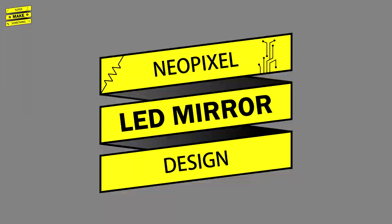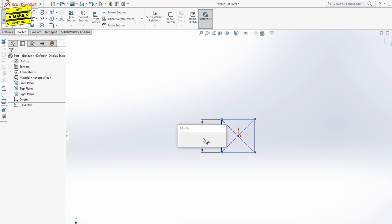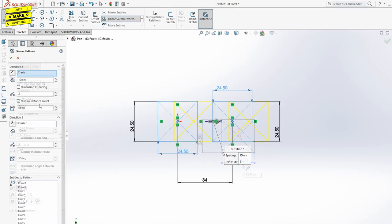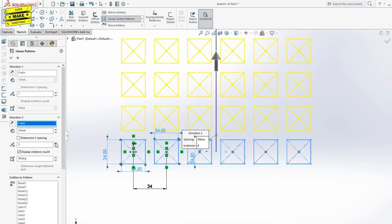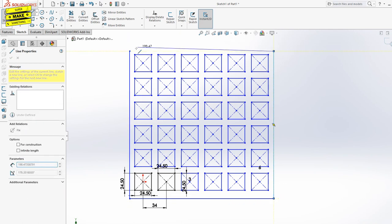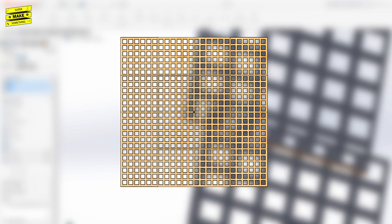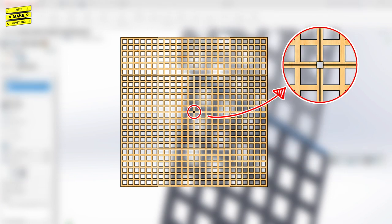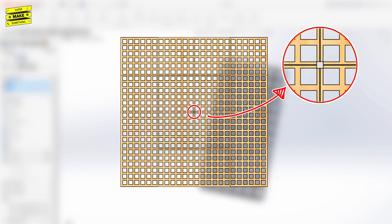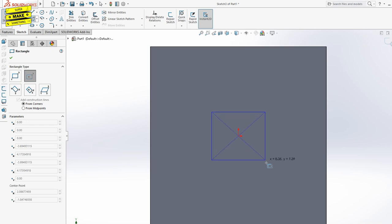I began this project in SolidWorks, a computer-aided design software package. I first modeled the unique laser cut mounting grids that would hold all of the 3D printed LED covers in place. These pieces consist of a piece of wood with square slots that will be cut out using a laser cutter. The spacing of each slot was based on the LED spacing of the NeoPixel strands, which have 30 LEDs per meter. The mirror has three unique mounting grid designs: one for the outer corner, one for the remaining border pieces, and one for the internal sections, which have a cutout allowing a 3D printed camera lens hood to slide in and keep light from spilling into the camera's field of view.